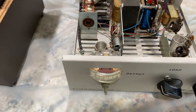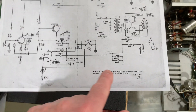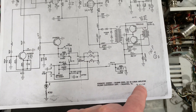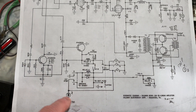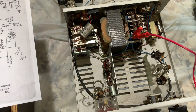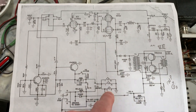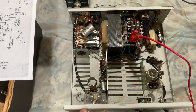This is one of the early prototypes, and looking at the schematic, you can see where they actually went in — some guy back in 1974 made all these modifications. They added a zener here, probably to regulate the filaments, which I probably need to add if it's not already been done. It's got a receive preamp, and the receive preamp is always on when you click it to operate.